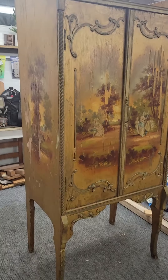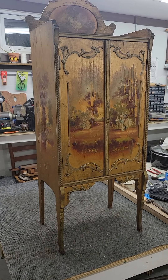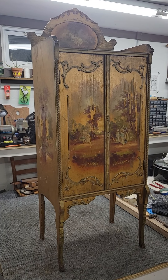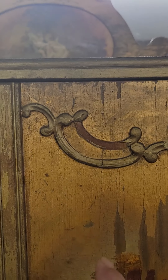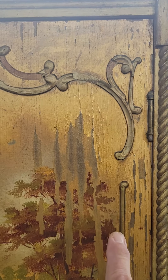What I'm going to do is put a cap over it and come down through that piece of wood to cover this area — it'll never be seen, it's the underside of a desk that's been manipulated. Just a thin piece of cherry to capture it so the drawers won't sag. It's got some joint issues that are kind of blown apart in places I just need to touch up. It also had a single poplar drawer bottom — one piece, a good 20 inches — pretty interesting.